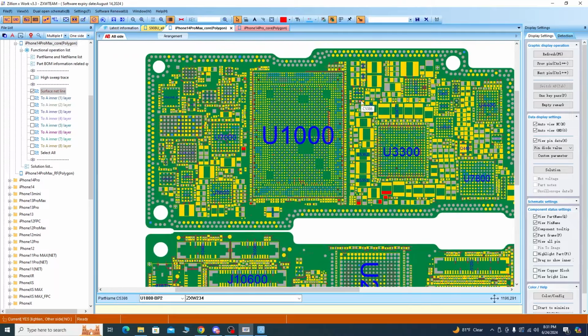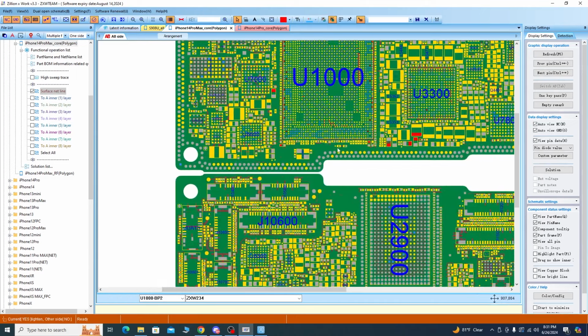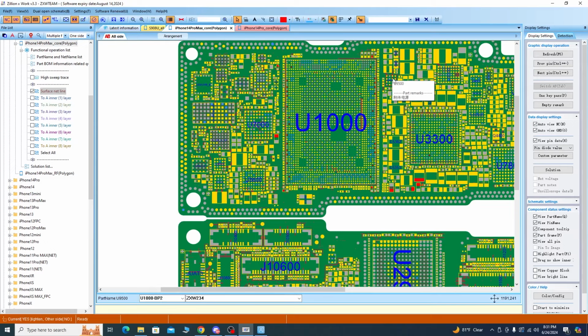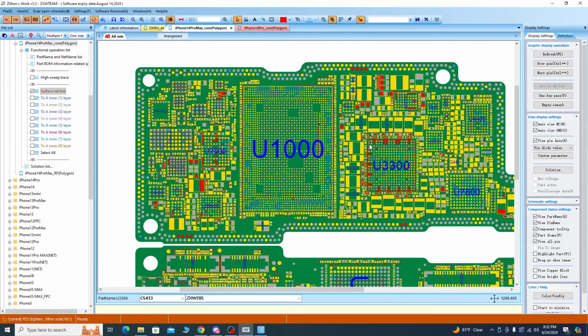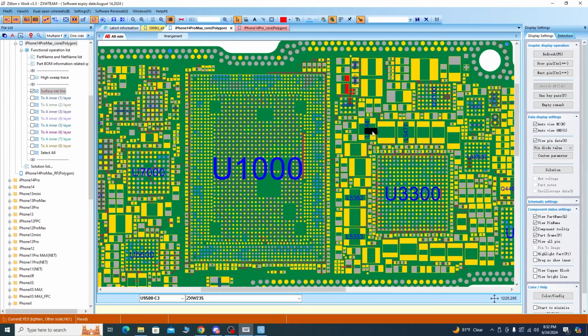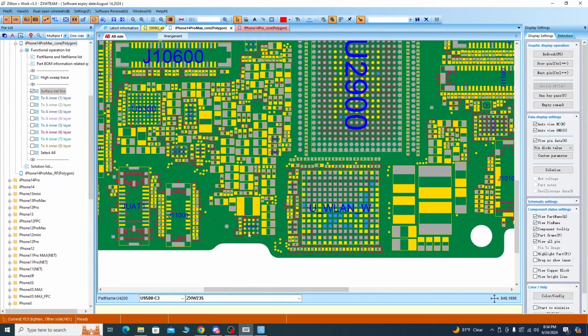And this is the shape of a boost coil. It's a 4x4 IC, and that's one of the only ones I see here. So it's almost surely going to be it, but there are other ways to check that. I'll have two lines that are main, two lines that are boost, and then two lines that are connected to the coil. And this might actually not be it, because it looks a little strange. So here's main. I guess this isn't boost, because this isn't the pattern I would expect to see. Unless they changed how boost works. Ah, this is almost surely it, right here.